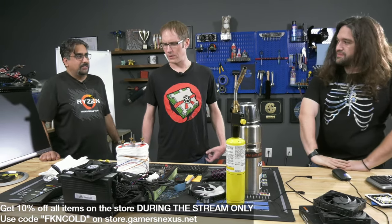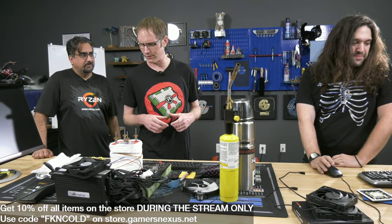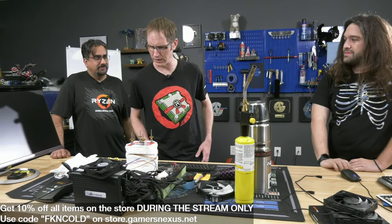On the bottom side of the socket it's all coated in Vaseline as well, with the heaters underneath. The AM5 socket plate is a little different and there's some air space underneath in the hollow area, so I melt some Vaseline in there just to make sure everything is covered.